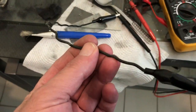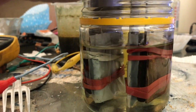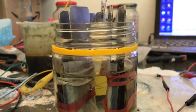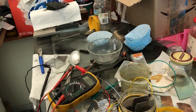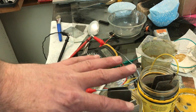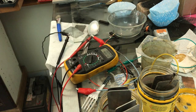Back — I have new alligator leads on some good copper wire. Let me clarify something first: I made a mistake in the other video. The build-up is on the positive side of both cells, not the negative. The negative side is the iron-3 hexacyanoferrate wrapped up in tracing paper. We'll check the resistance of the cell first — we'll do the manganese ones with added carbon and the plain metal hexacyanoferrate cell with no carbon, only the carbon felt.